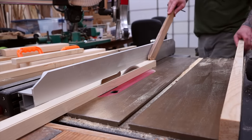Before installing the cross slats, I'm going to add pocket holes to the ends of the two side rails that are an inch and a half wide. This will allow the bench to fasten to your planter — it's optional since the weight of the bench will hold itself in place, but useful if you want to lock everything together. Once the pocket holes are in, attach the inch and a quarter side boards to the inch and a half side boards using exterior wood glue, leaving a quarter inch overhang on the inside. Repeat for the second rail.